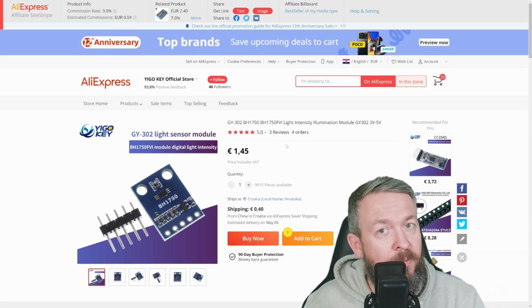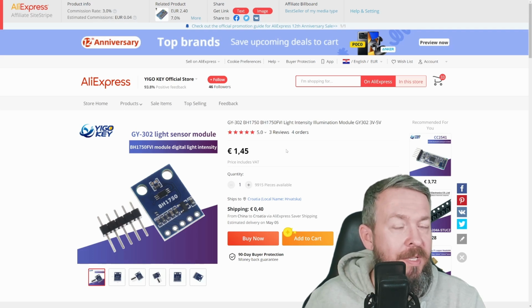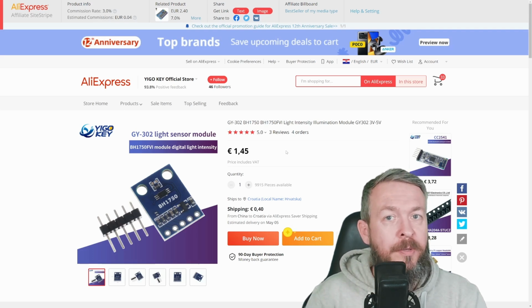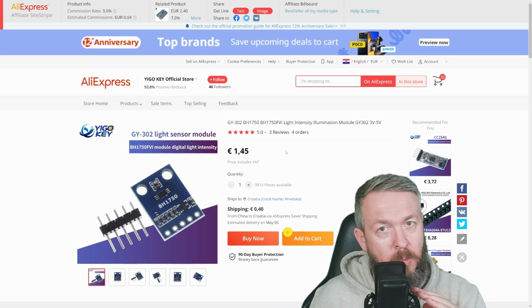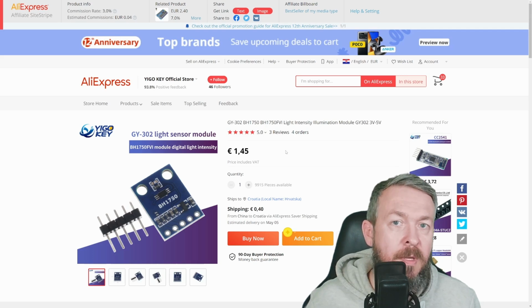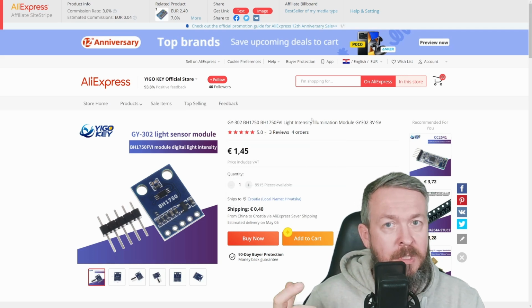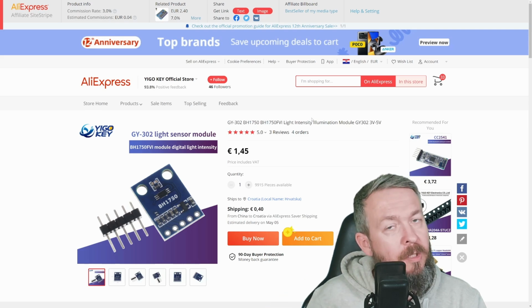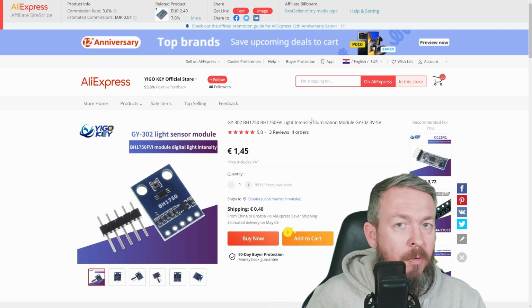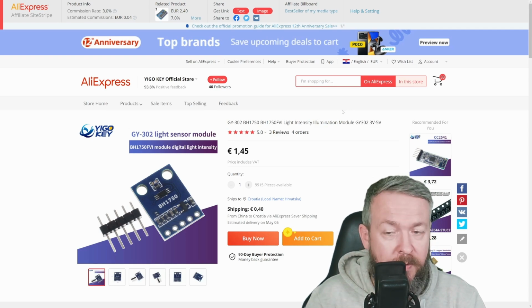The next thing I've learned through the ESPHome coding is that this sensor can work in two modes. The one I would call internal or home use, and the other one is external. And this will either make sensor work better with the lower lux values, or it will work better with the higher lux values. The new ESPHome release has support that automatically switches between those two modes. Previously, you had to select either mode A or mode B, but now it's done automatically. So yeah, a little bit of trivia.